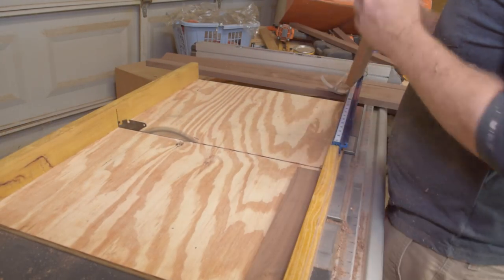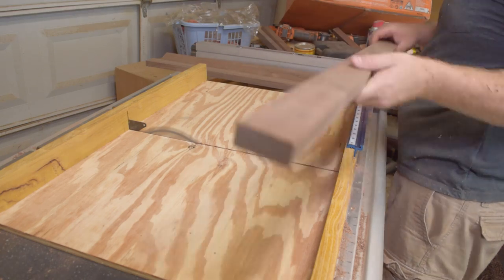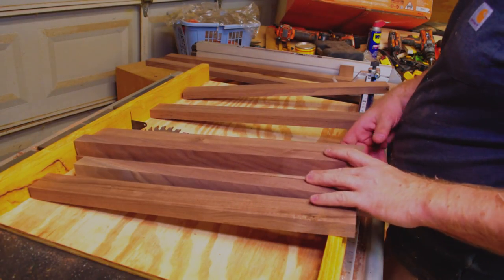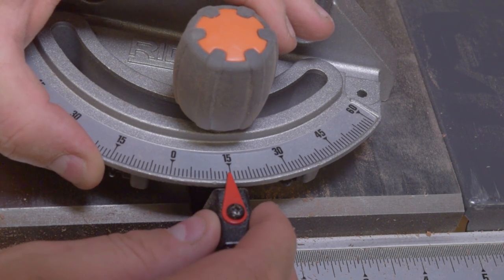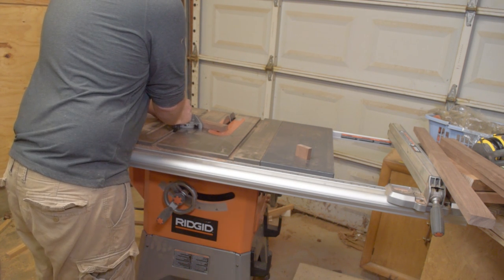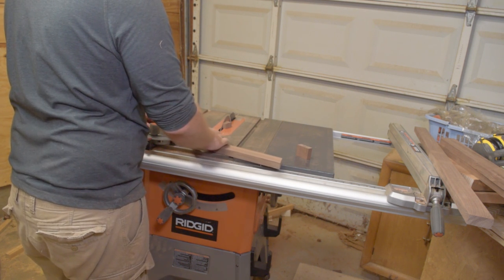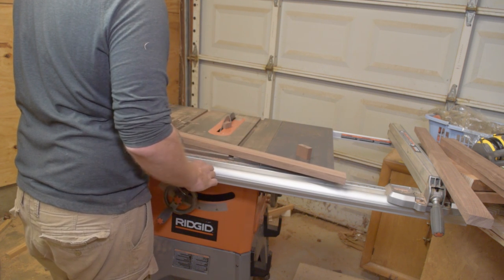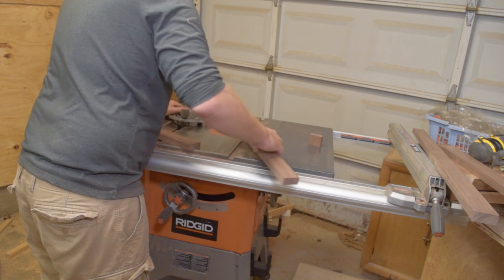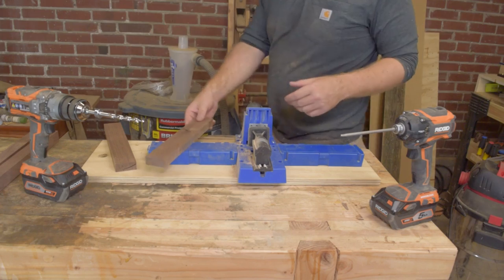I continued to cross cut the pieces and got all my blanks prepared. After cross cutting, I put them through the planer and jointer — I've got another video on stock preparation on my channel if you want to see that specifically. I laid out all the blanks to figure out how I wanted the grain to run, then set the miter on the table saw to 15 degrees to splay out those front legs so the stool would be more stable. I'm using a new saw blade from WD Quinn's saw company — it cuts amazing. I used a mock-up to figure out how long the splayed legs needed to be rather than calculating with math or Sketchup.